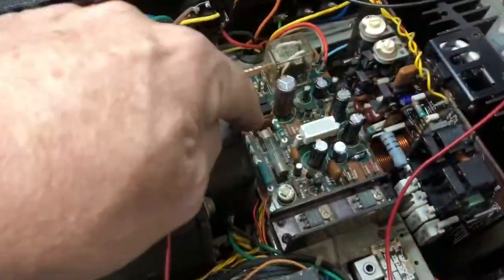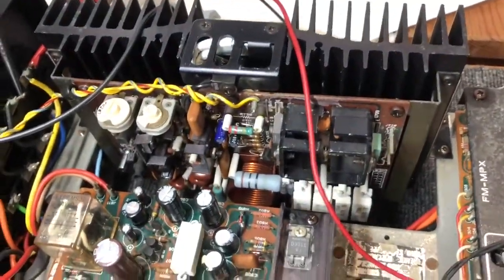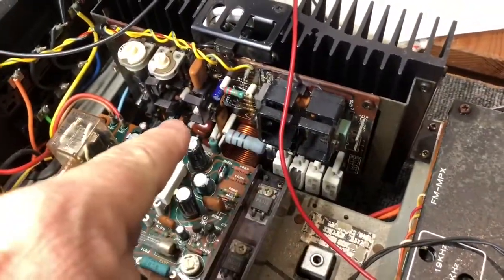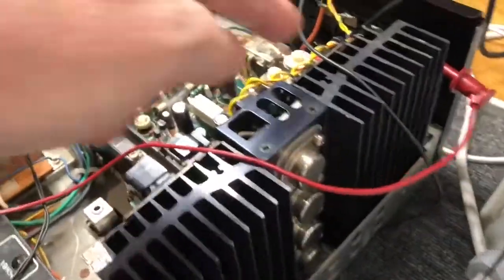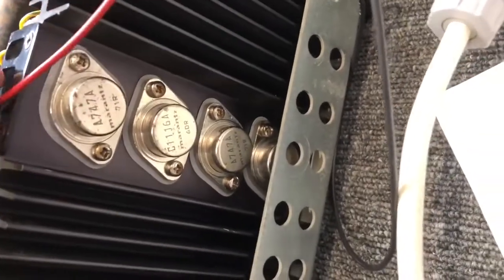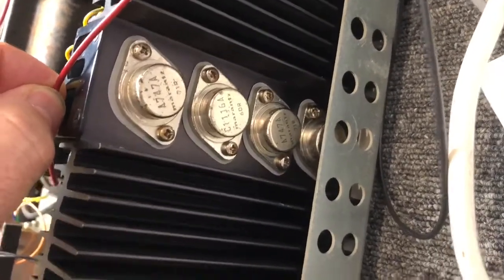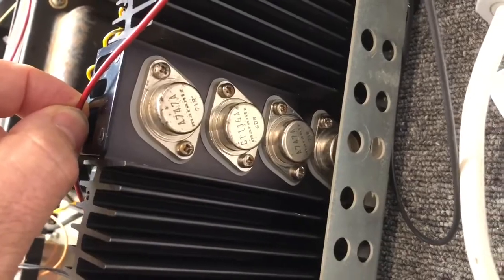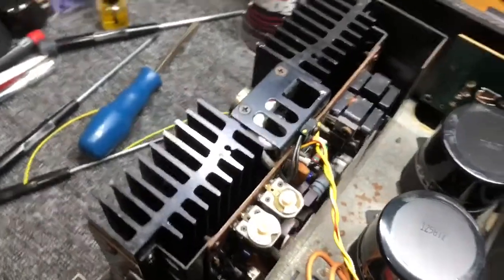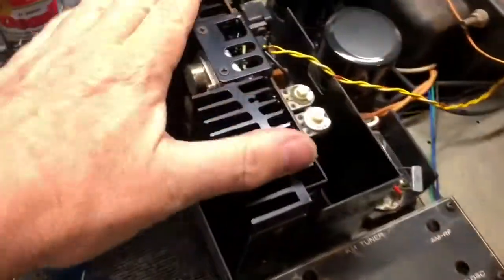So we've got the main filters and the regulator board. Then for each of the two amplifier modules — here you can see the amplifier module, it's a discrete module that comes out on its own — I replaced all of the electrolytic capacitors and reworked a lot of the dry joints on the underside of the board. What I always do to improve reliability on these older amps is remove, clean, and test all the output devices, then remount them on nice silicone thermal pads. I did that to both channels and they now operate beautifully.